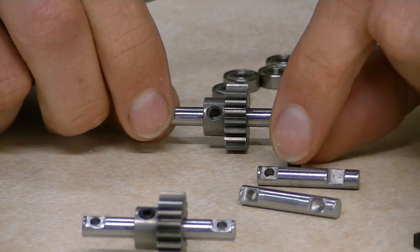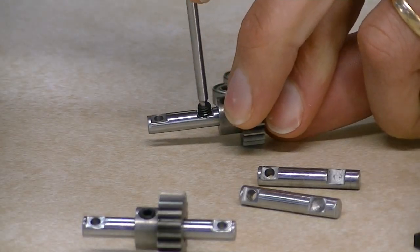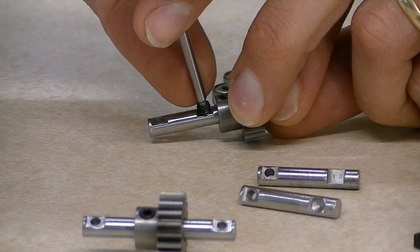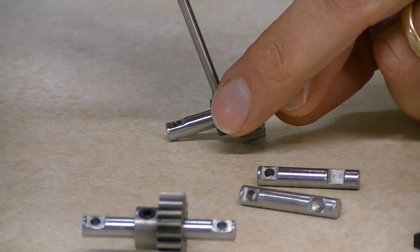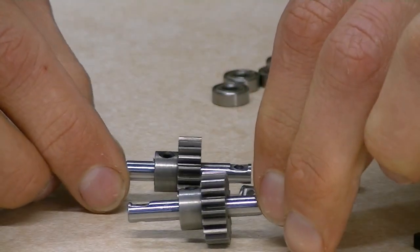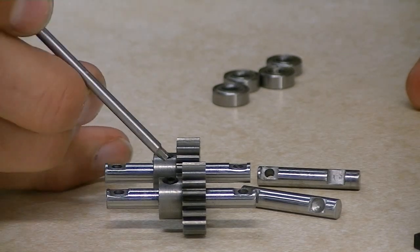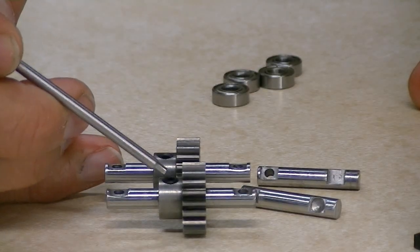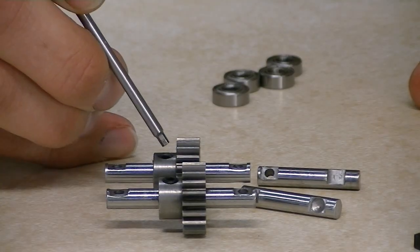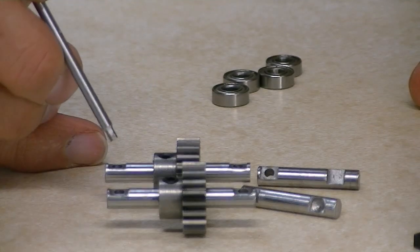The way that this works is very different from the flat bottom one. With the new screw hole, the set screw actually sits in that hole — it sits right inside the cup. So it doesn't just sit on top of the flat; it actually sits down inside that cup that we have now drilled into there. Now if you can see these two — this one here in the front is the one with the flat. The set screw actually sticks out just a little tiny bit on the flat. This is the new one in the back, and the set screw goes farther down. So we actually removed the flat spot and replaced it with a proper hole.